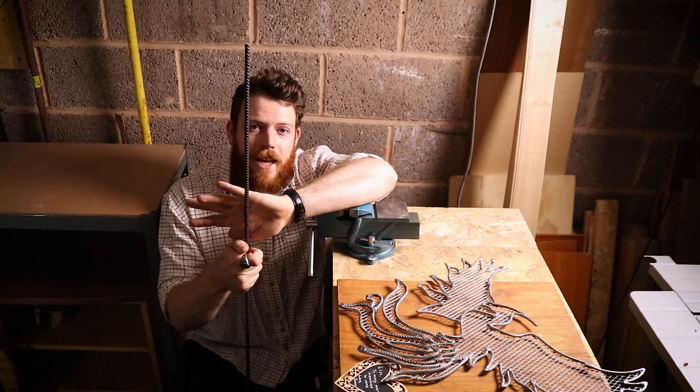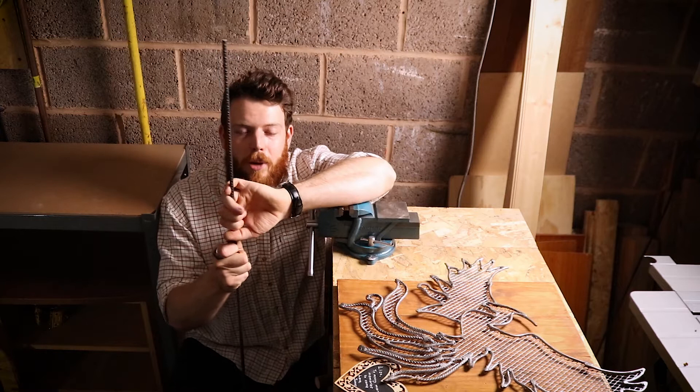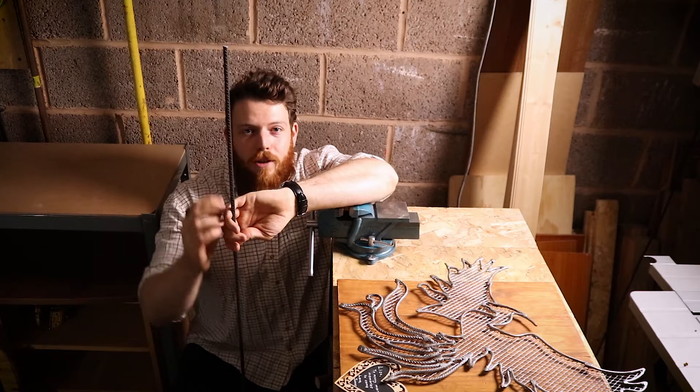What I've got here is some 10mm rebar. This is probably the thickest thing you'll be bending with this technique because you are going to be bending it by hand. I'd recommend buying in lengths of a meter or two meters and don't cut off the section you need, because what we're going to do is use the length of this as our lever to get that bend.